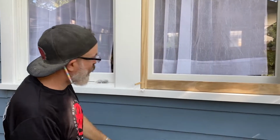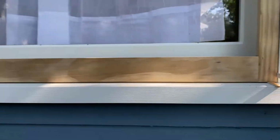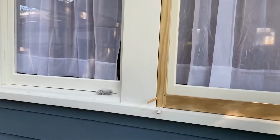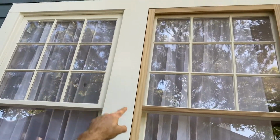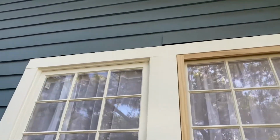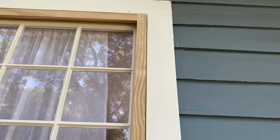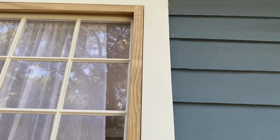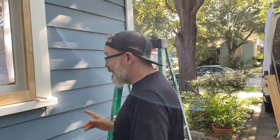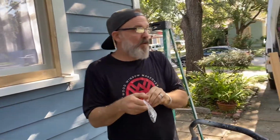See, that's perfect. See that? Here's something else. You can't see it, but there's a bigger gap on that side, I think. See how it's touching on the right? I got a bigger gap over there. Here, see if you can watch this side here. Ready? Oh, see that? Isn't that nice? Boom. So I got a nice even reveal all the way up and down. So now I've done that, now I get my hardware, okay?